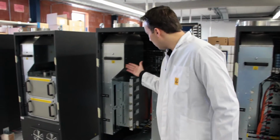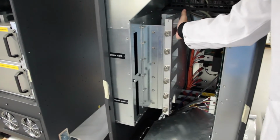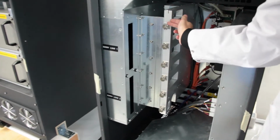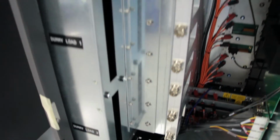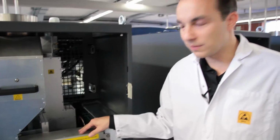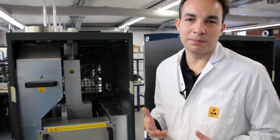So a few minutes before we talked about the 6 power amplifiers. The 6 power amplifiers are combined thanks to our rock solid and passive coupler. When we say passive, it means that there is no component in this coupler, and as you can see also there is no cable, meaning that we connect directly the amplifier to the coupler, and the coupler will also be directly connected to the dummy loads. The coupling loads that you can see on the next rack, which is here, are those modules. We have 2 modules here, and those modules include the coupling dummy loads, and those dummy loads are big enough to handle a full power unbalance at the amplifier stage.